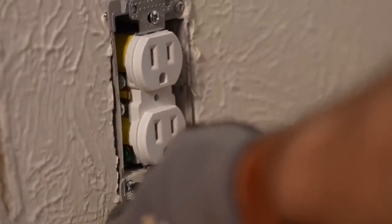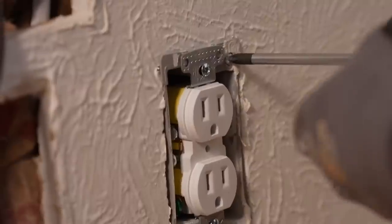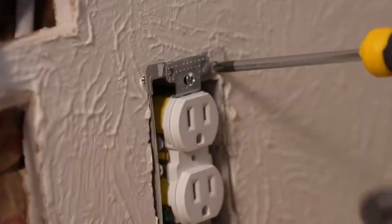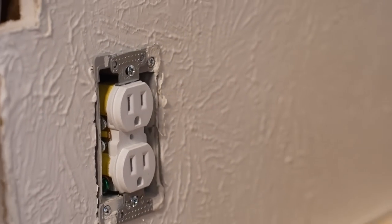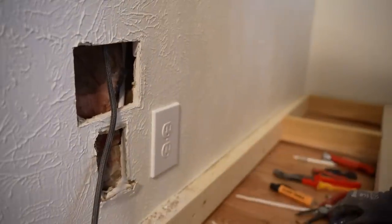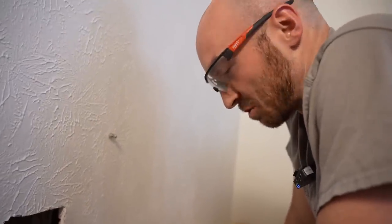Now you're just feeling for resistance — you can see it's actually starting to pull itself into the wall. I want to make sure it's nice and tight. Same thing up here — it can be tough to feel. There we go, a little bit of grab. And a cover plate — a flathead. Go ahead and comment below if you're a vertical or horizontal screw person. Joel's a horizontal guy, so I'm a horizontal guy; that's how I learned, but I could maybe be swayed.